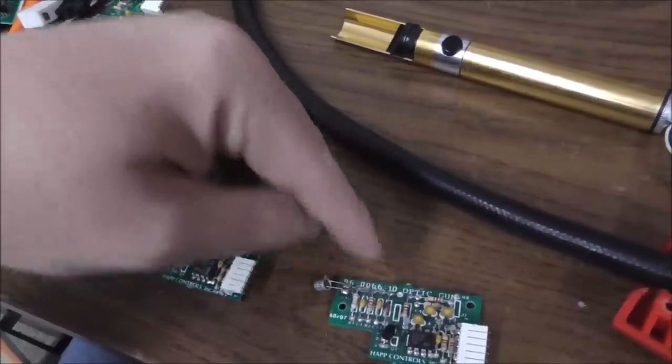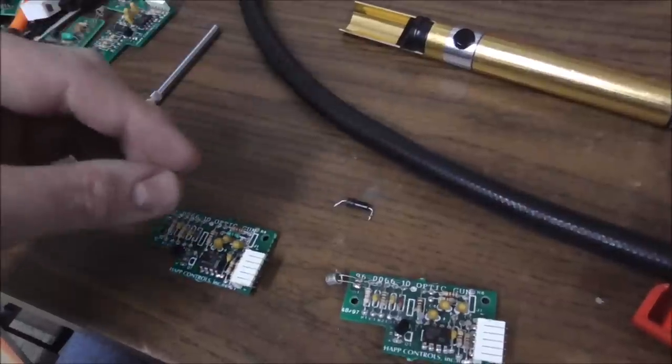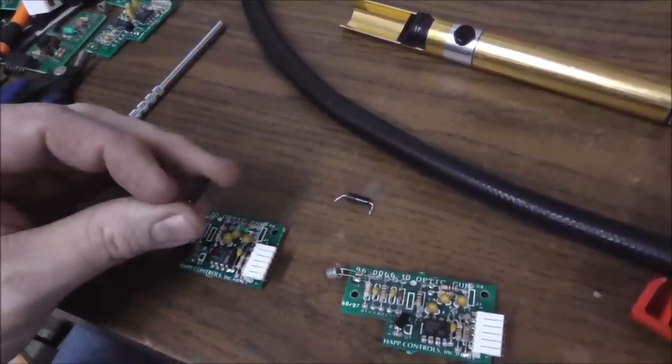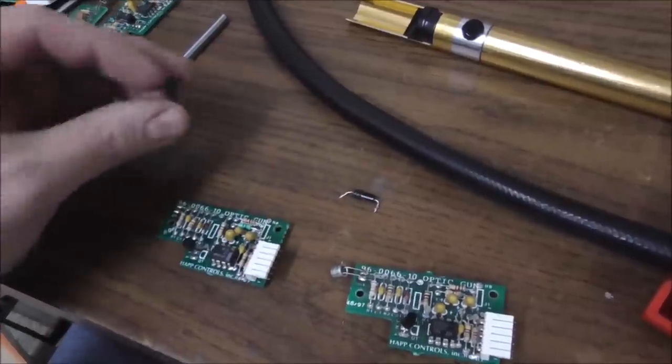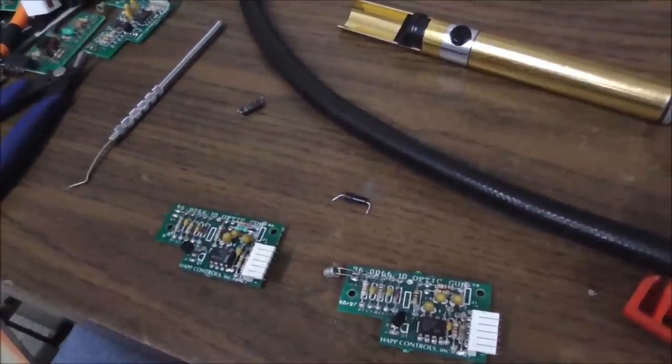There's no way really that you're going to take it out of circuit and it's fine. Because if this is 47 and I'm testing it in circuit, no matter how the rest of the circuit is, from here to here should be 47, or it could be lower, because there might be something next to it that's lowering the resistance. It should never really be higher.